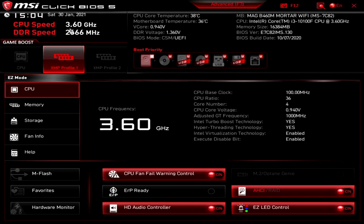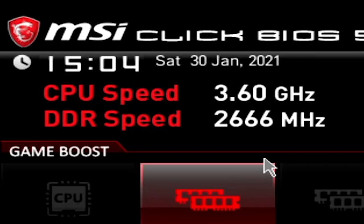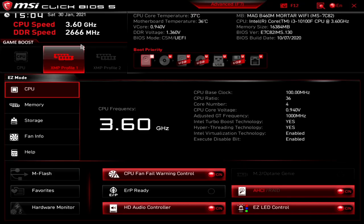So in the main section we've got DDR speeds. DDR speeds on this board are something of a bit of a nightmare — it's quite locked down, as is the CPU itself. With an i3, i5, or lower processor, the maximum speed the system will allow is DDR 2666. If you're using an i7 or i9 on this board, you can get it up to 2933MHz, which is still a little bit shy of what AMD allows. Intel chips aren't as affected by high-speed memory as AMD.